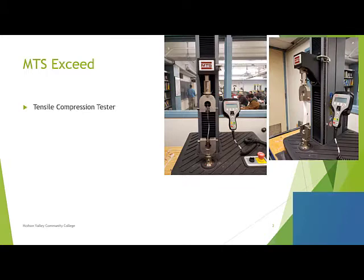All this does is pull or push the test specimen, and then we measure the load versus deflection. Looking at it from the side, you can see the piece of paper mounted in there. This head just moves up and down at a very precisely defined rate from the computer software. It pulls or pushes the specimen and you measure the load versus the deflection — so pounds versus inches, and newtons versus millimeters.